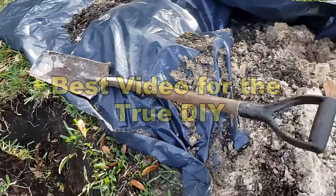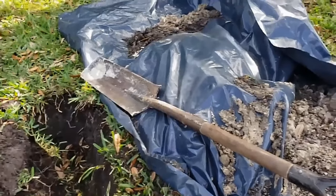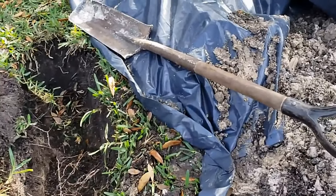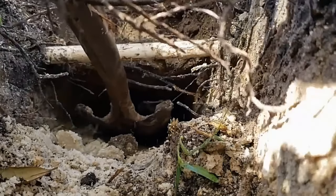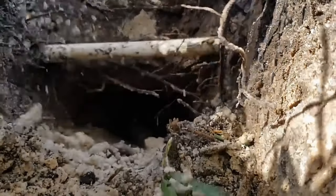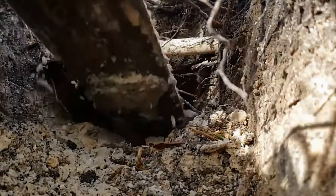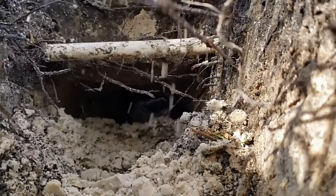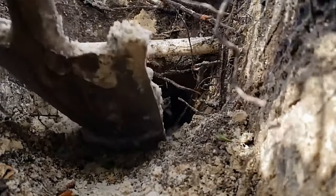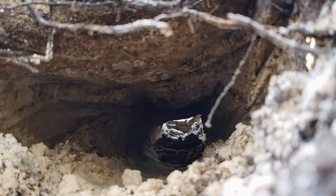We also use what we call a sharpshooter — a smaller spade that's 16 inches of steel by six inches wide. After you dig as far as you can with your big shovel, go ahead and use this little shovel and you'll get right through. Now I'm using the little shovel and I should be almost through — yeah, you can see me pushing it all the way through. Just pull it out, get your dirt out, and clean out the hole. The secret is to stay at the top. Irrigation lines are a pain, but you could cut them if you wanted — there's no reason to though.